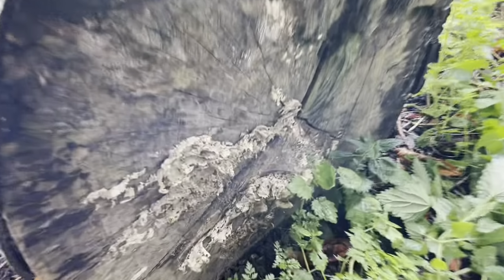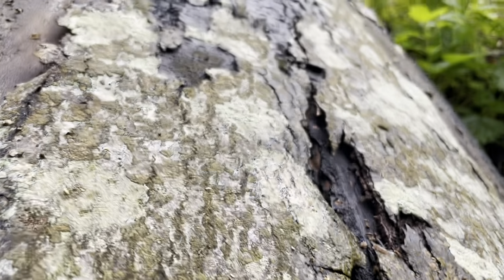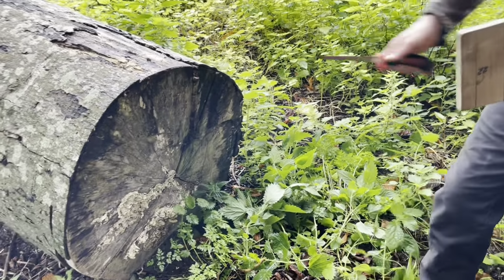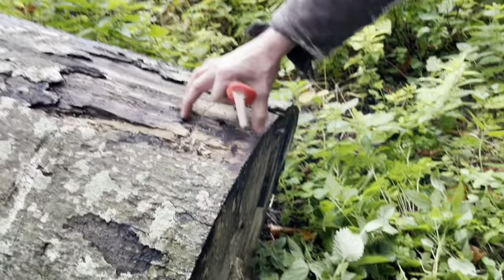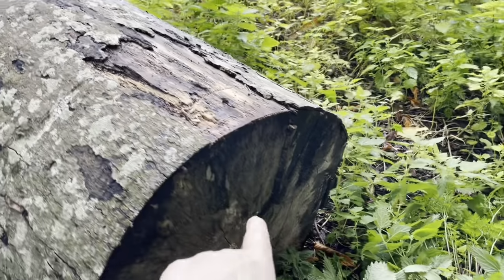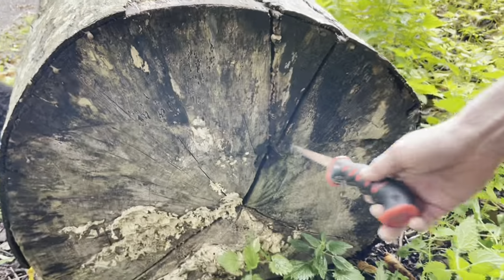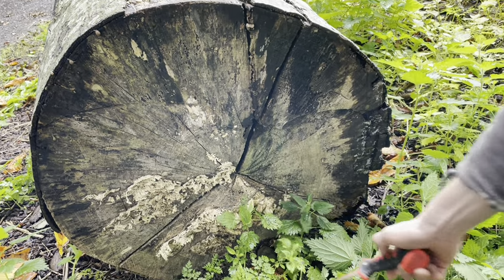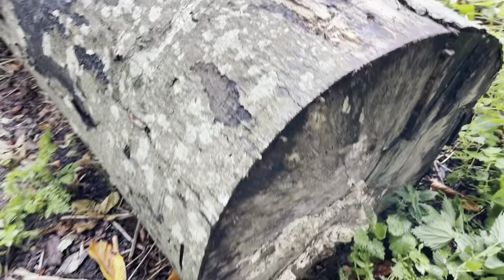And this has beautiful fungus in it and a big old nasty split. So what would you do with the end of this here? Well, the first about 10 centimeters is just going to be waste because it's all going to be cracked. It's going to be firewood. But that always happens. Yes, it's a routine kind of thing, because it's been down so long. And this split that's here, I can work around that. I can get the bowls from this side of the split and this side of the split. Ah, very good. So that's not a problem.